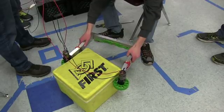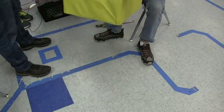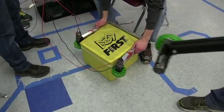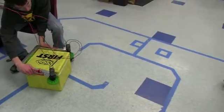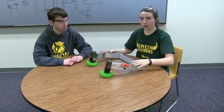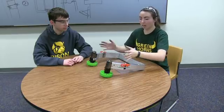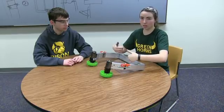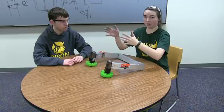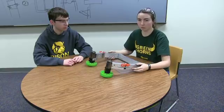The reason we went with these wheels is because they provide the perfect amount of traction on the surface of the crate. The wheels will provide lift for the front of the crate, and we'll have a back plate on the back side, staying within our frame perimeter. We'll have a wedge on the front so we can glide under and lift the crates. Another option is having a friction material in the back so when we drive the crate in, it wedges into that surface and we can still lift. The challenge is when the crate is in its thinner 11-inch orientation — we'll still have to figure out how to provide traction in the back.